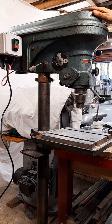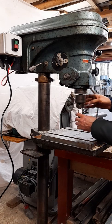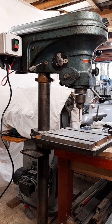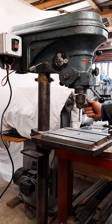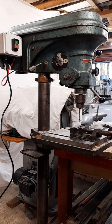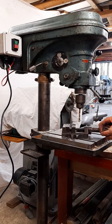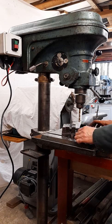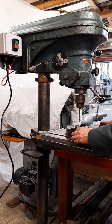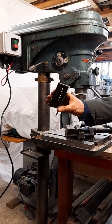The top cover, although it's pressed steel, is actually quite strong and quite well made. Okay, so let's get a drill bit in there. We're in the lowest speed so we'll drill some steel just to give you an idea of what it can do. I'm going to use these T-nuts and just a bit of scrap mild steel angle, probably about 4mm thick.